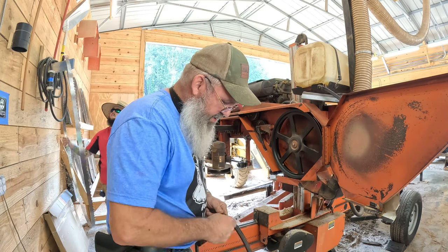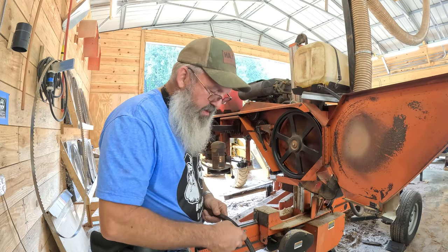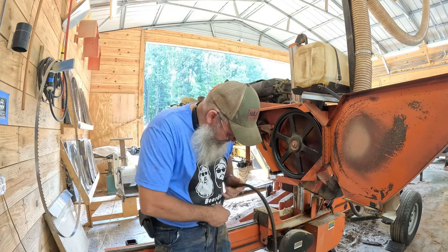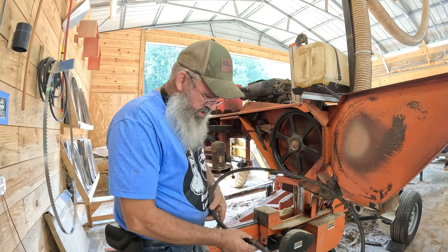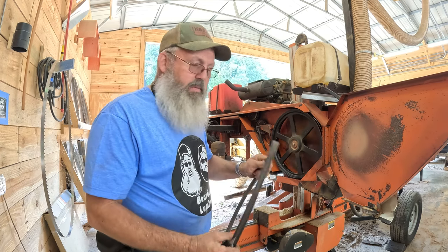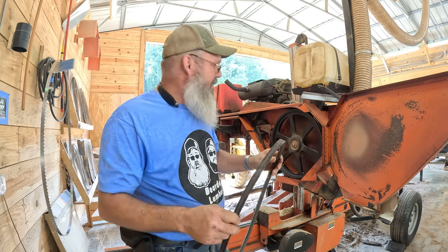As far as the hours, everybody's different. I used to not get that many hours out of it. A belt, maybe 50 hours or so, and I changed the belt. And come to find out, most of that was because we weren't using the strain gauge and we were running way too much tension on our bands. Now that I'm running appropriate tension, these seem to be 150, 200 hours, maybe more, to wear them out.